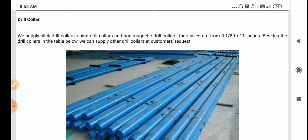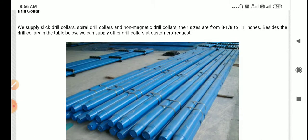What are the different types of drill collars? First, what is a drill collar and how do they look? See here the image. We have two types: slick drill collars and spiral drill collars. The body of the spiral drill collar is not straight — it has flutes, where some material is cut in a spiral shape. Slick means normal, similar to how a drill pipe looks.